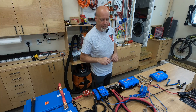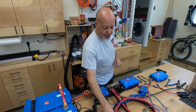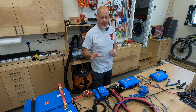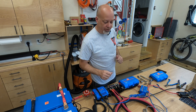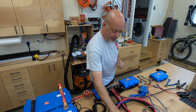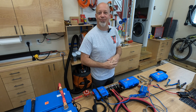Explorers.life has a lot of videos on this connection, and they show it with the MultiPlus. That case ground is much easier to get to — it's not inside this casing like this one is. So just be mindful: if you have a MultiPlus, you can probably go all the way up to 4-0 for your case ground. But with the MultiPlus 2, if you've got 4-0 here, 2-0 does fit to the Lynx distributor. Case ground situation corrected. We'll see you on the next one.